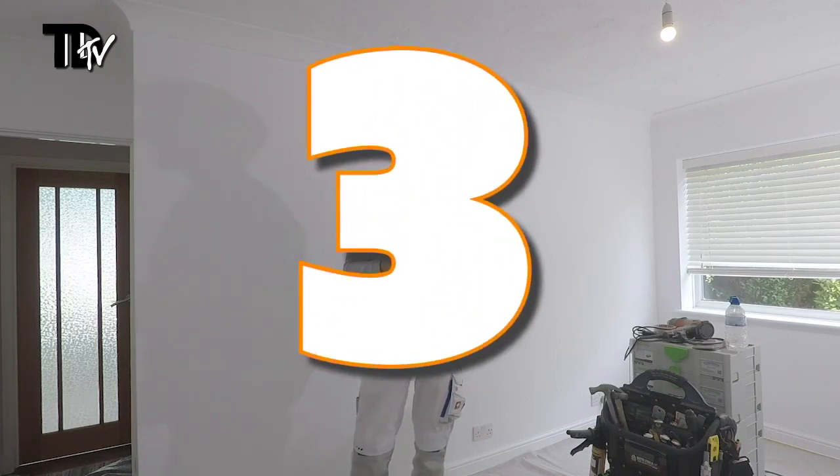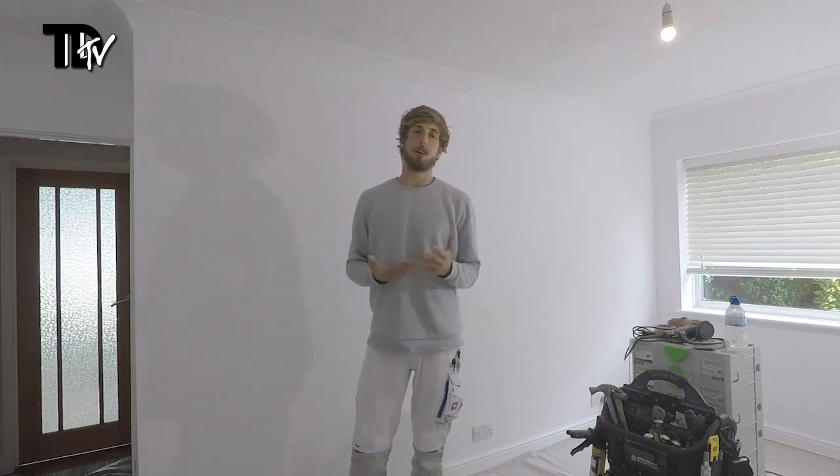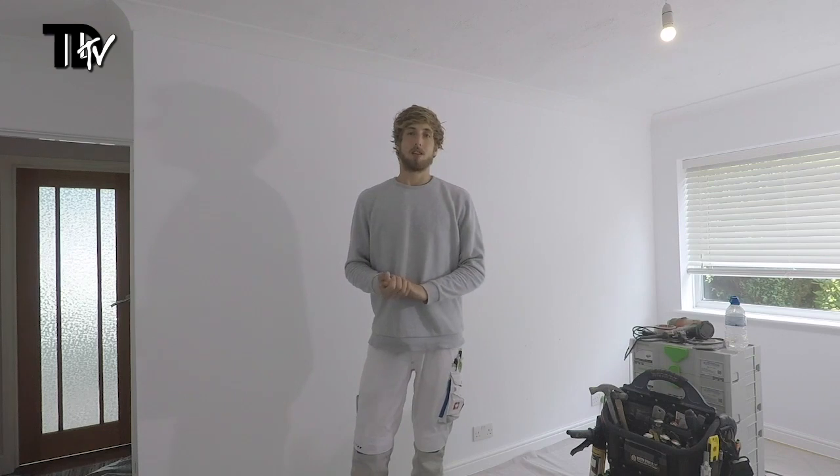The third thing I like about this paint is that it's wipeable to a degree. Because it's a co-polymer acrylic matte, it can be wiped. So for bedrooms and things like that, in a rental property like this that don't require a really high spec paint, this is the perfect product to use. It can also be used on relatively new plaster which needs to remain breathable. So it's got a few uses, and as I said it can be wiped, which means it's great for these sorts of environments.